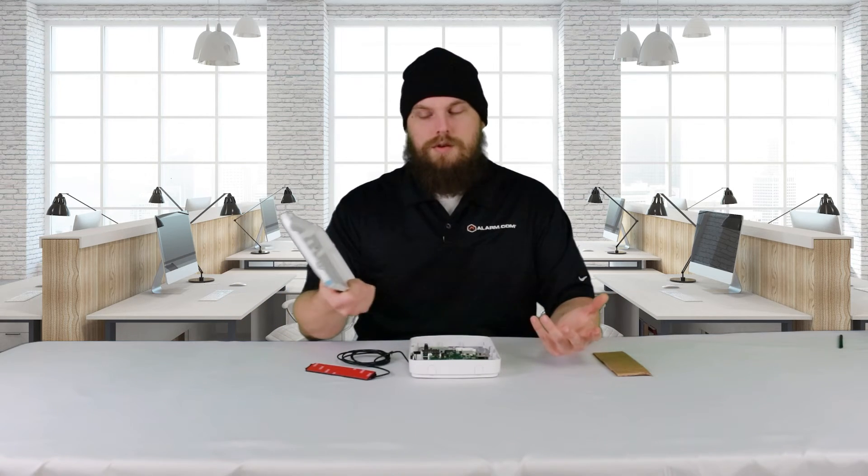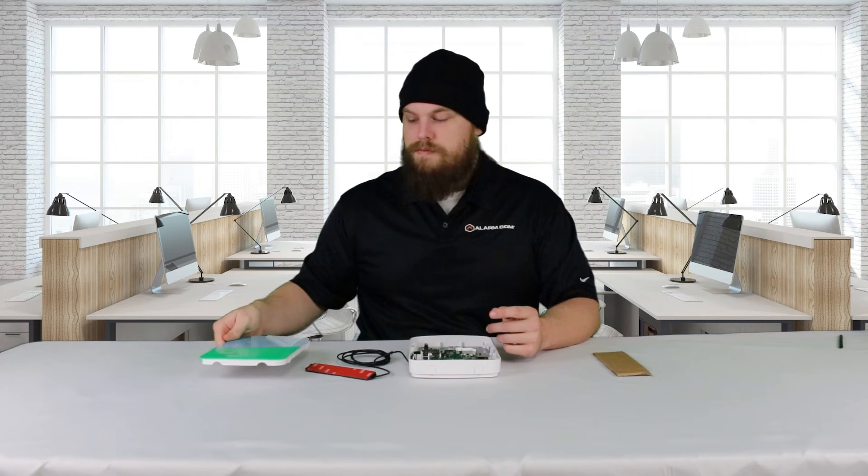Nothing too crazy in this video. It was just a common trouble that we run into whenever our customers are trying to install this unit or have installed it already, and they get to finishing up the system, and they notice that there's a trouble condition that says alternate communicator, but the cover's on. Well, it's that back button. So, like I said, if you haven't installed yours yet, the best thing to do is try to find a stud, mount that button directly to the stud, and that way you have as much wall force as possible pushing against that button just to keep it level. If that doesn't work, cardboard is a secondary, very effective method. That's all I got for you today. Hopefully this is insightful, and for those of you out there having trouble with it, it helped — I will catch you guys on the next one.